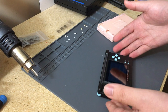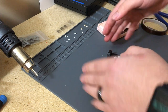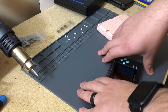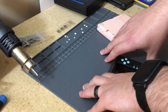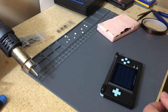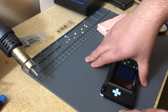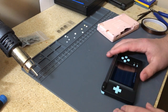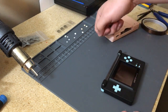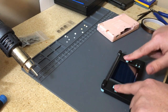And a lot of these higher end chargers, like for MacBooks and Switches and a lot of the phones nowadays, the chargers themselves don't supply voltage, or at least from my understanding and reading about it, because I've tried to make sure I do everything correct. They have like a chip that essentially says, hey, I want this amount of voltage supplied to me, and this amount of amps. And a lot of the chargers won't supply it unless the device asks for it. And that's why you can use a MacBook charger on a lot of different devices, like smart devices or different MacBooks or phones and whatnot, and they all work together because they are smart, while these ones are not.